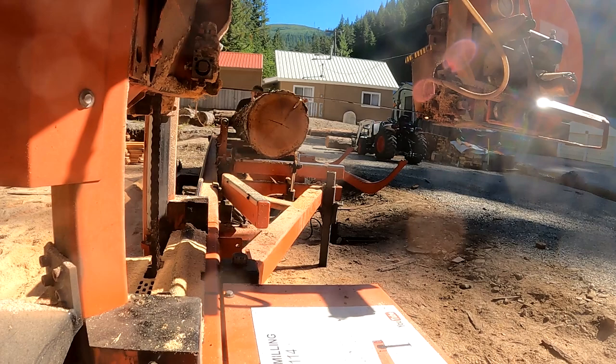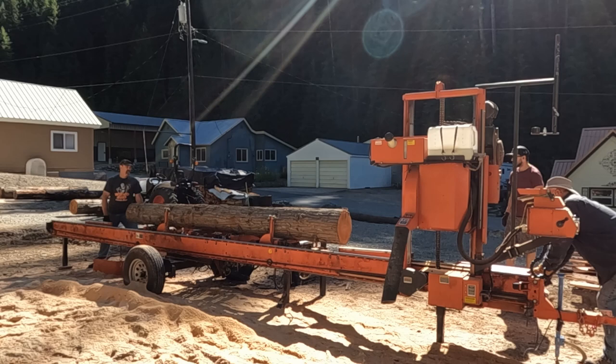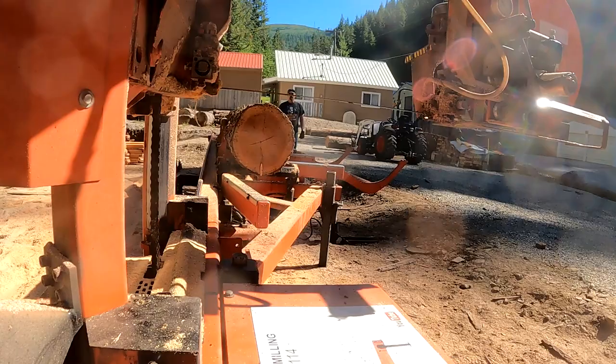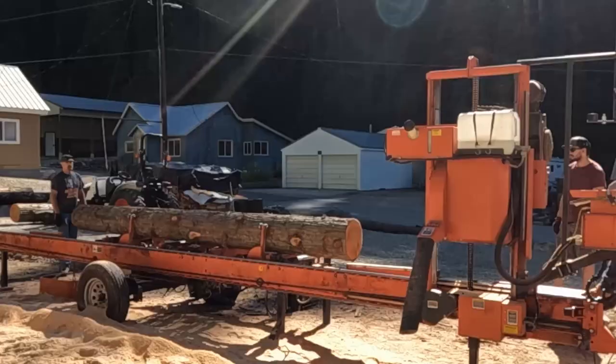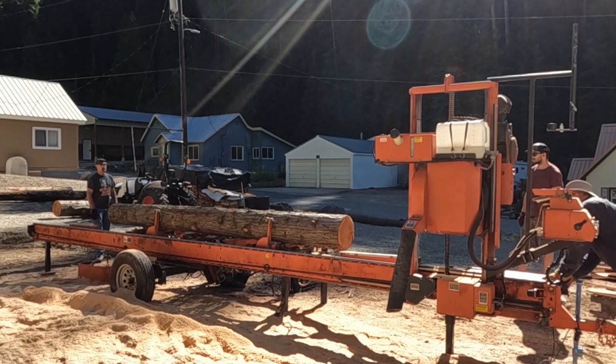And then I'm going to roll it around a little bit, look for the stress. Try to get my stress horizontal so that as I mill the log, I can pay attention to where my stress is. You may have heard me say this before, hooks to the right. That's just so that I've got my stress horizontal. I can take off that first cap cut, and when I roll it up, I'm going to mill that face off knowing that I'm going to be milling through reaction wood.